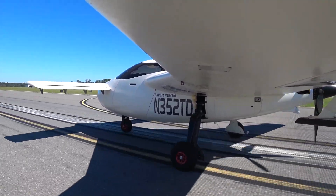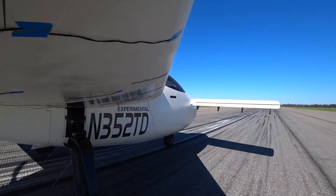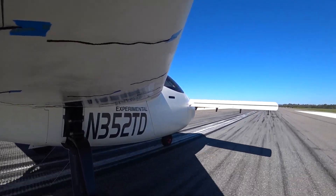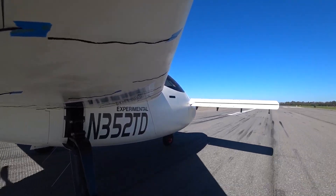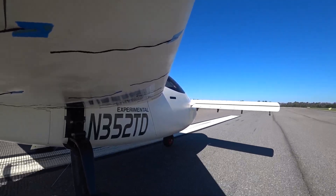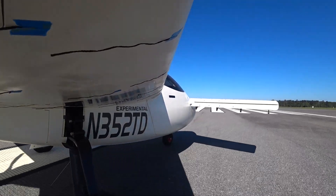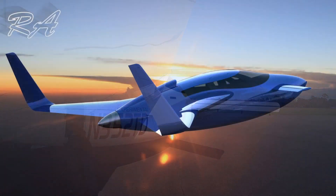I still have a bunch of stuff to do: get the new tanks installed, dial in the CG, and set the elevator trim for takeoff so the aircraft comes off with trim pretty much where it needs to be for level flight. With the CG moved forward, the aircraft should be flying at maybe one or two degrees nose up instead of five degrees like before. That should help with stability, cooling, and power efficiency — the foreplane will carry more load, and its profile generates less drag than the wing does producing the same lift. Anyway, that's a quick update for this week — tune in next week, thanks for watching.